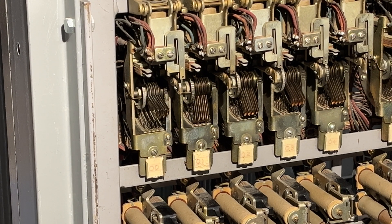There is the potential for 25 outlets or 25 first selectors; we're only going to be using 10 first selectors, and those are going to be shared amongst a multitude of line groups such as two 25-line rotary line groups. There's a second one, then there'll be a plunger line switch discussed in this video, and then the more traditional line finder which hasn't yet been wired but will be later on.